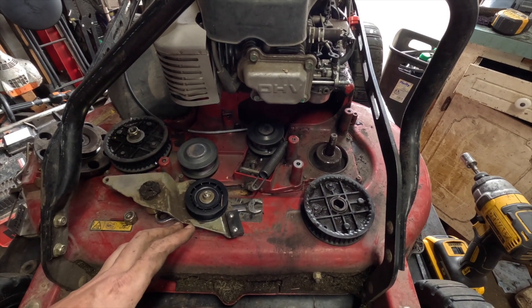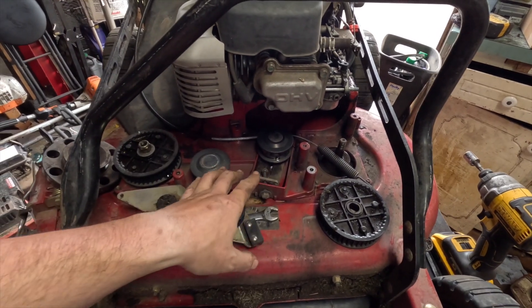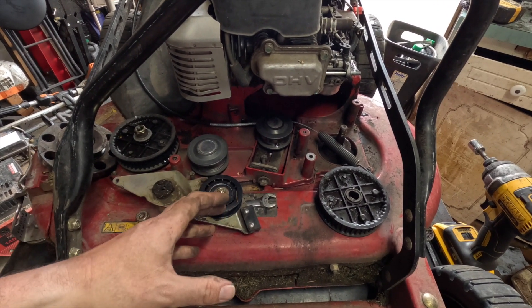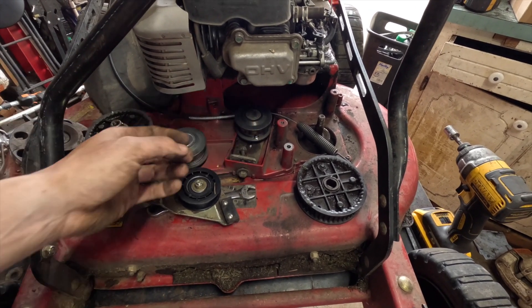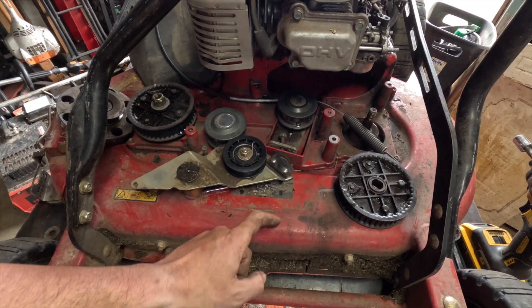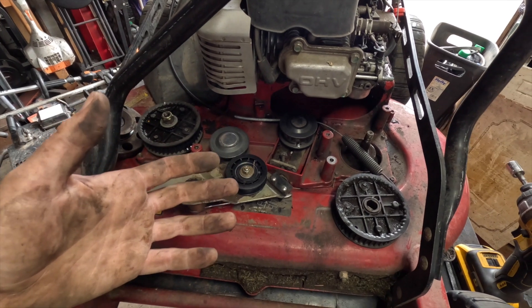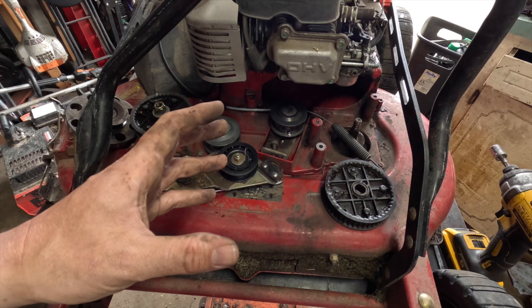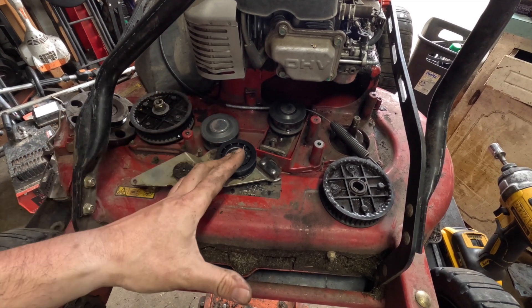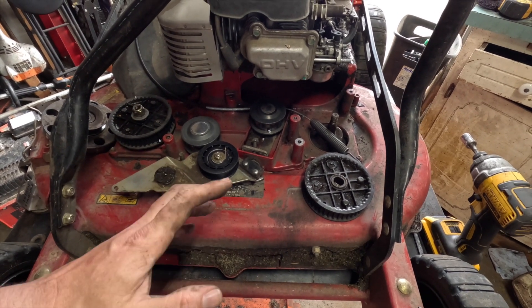I'm going to show you how to tighten the belt. The problem is I'm not going to show you how to tighten the timing belt because this particular machine is missing a little plate. Technically you're supposed to use a feeler gauge in between the plate, and the spec says five to thirty thousandths of an inch - that's 0.13 to 0.76 millimeters. That's pretty loose, so you just have to have enough tension so it's not going to slip off. I don't have the plate and the owner needs it today, so I'm just going to show you how I tighten the belt from the crank to the pulley.